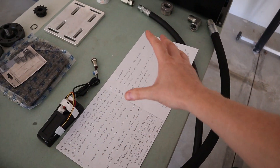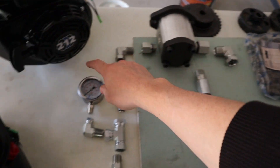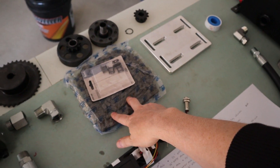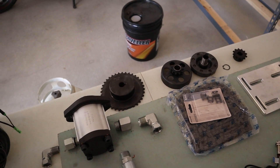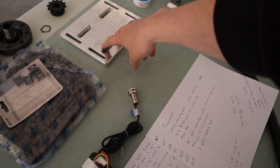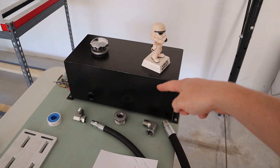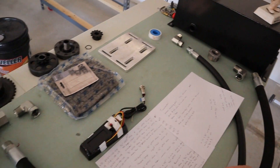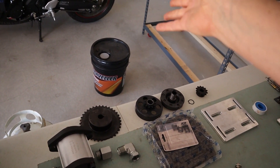Here's a quick price breakdown. The pump costs about $110. Pressure gauge about $10. Control valve about $40. Tachometer $20. The chain with master links was about $17. The sprocket was about $36. A clutch can cost about $20 to $25. The motor mount plate I picked up for $31. Teflon tape is about $1 to $2 for a roll. The tank costs about $70. All of the hydraulic fittings together cost me about $45. And the hydraulic fluid — I picked up a 5-gallon tank of tractor transmission hydraulic fluid for about $35.